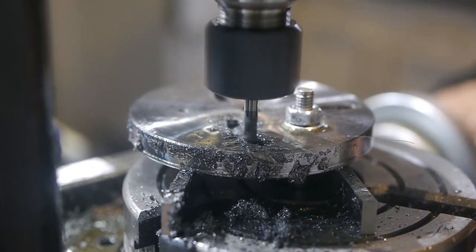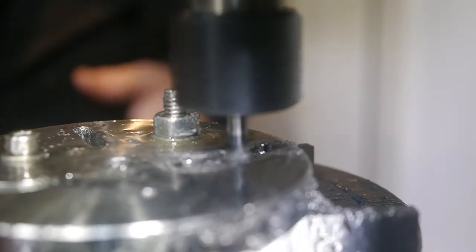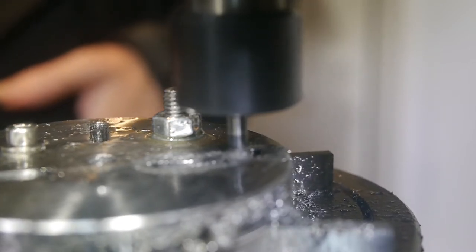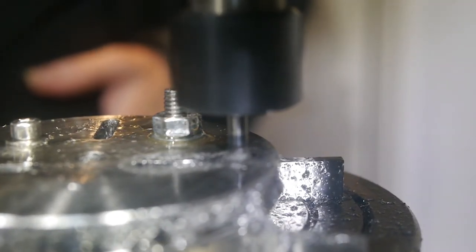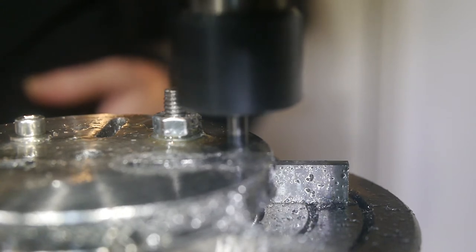Finishing this slot completes the slot geometry of the faceplate, but the three holes are still to be machined out to their final size. Up until now, their only purpose has been to hold the part. In the final tool, they are used to view the work being held by the faceplate clamps while adjusting the tension of the clamps from behind.